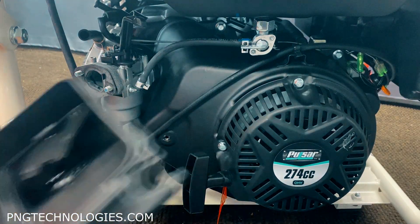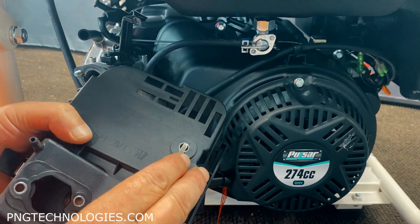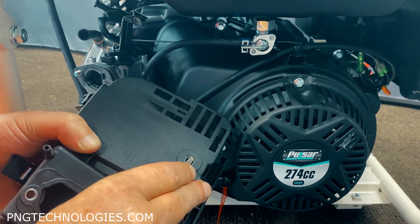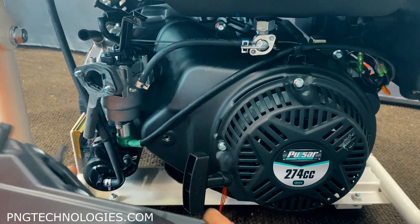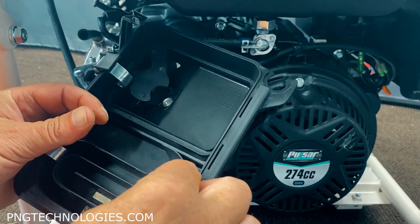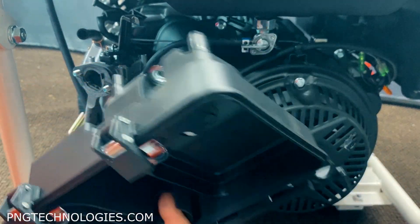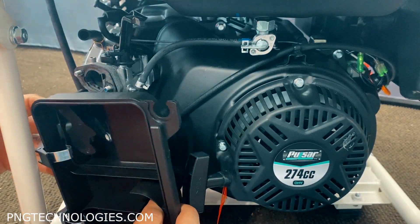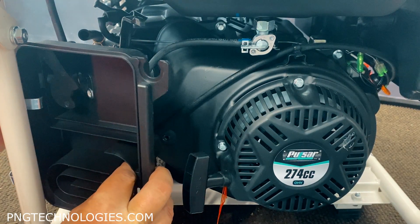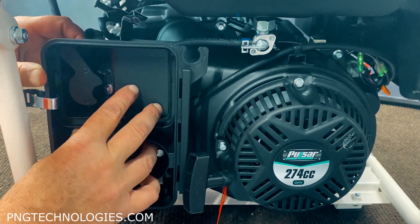On the air cleaner, this back box where the vibration mount is, there's a little metal bushing here. Just press that out - it presses out fairly easy. Then we'll supply you another bolt and a spacer for back here. Just line the top and front up first so you can get that started.